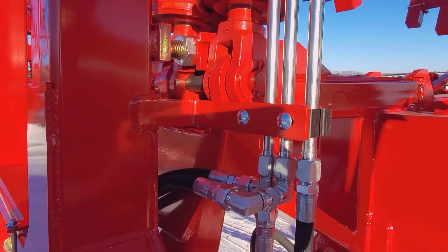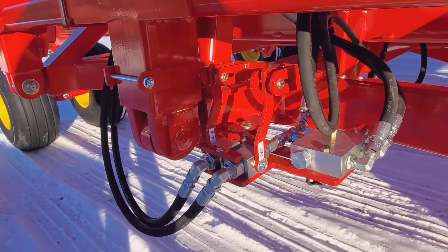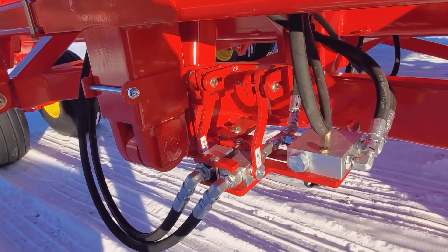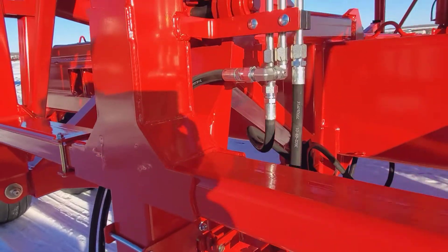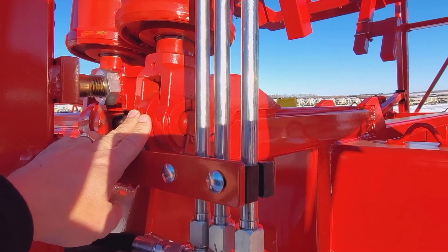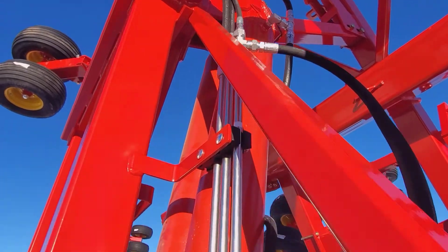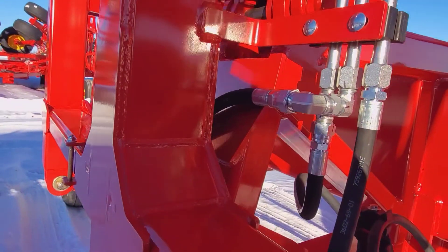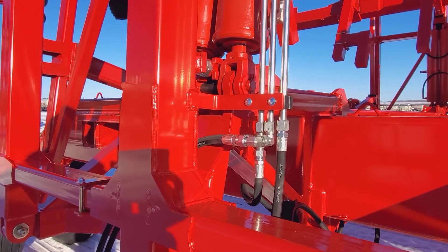It's a fairly simple circuit. The rods are connected to the main frame portion of the drill — they're fixed pins. As the wing frame comes to the ground, these two ball valves change: the inner wing flow is now closed and the outer wing flow is open. We have fixed pins on the main frame and on the base end of the inner wing cylinder on the inner wing frame, so we have to stop that push so we don't wreck these cylinders when that frame is down on the ground. That's why we close off the flow to the inner wing cylinder.